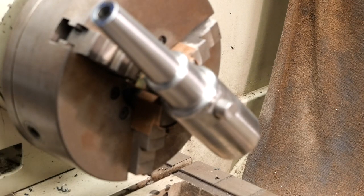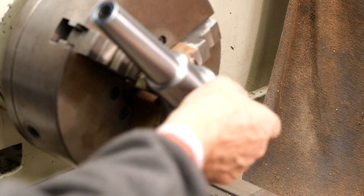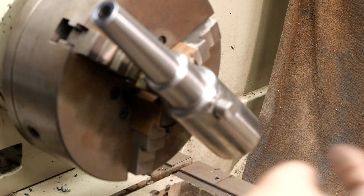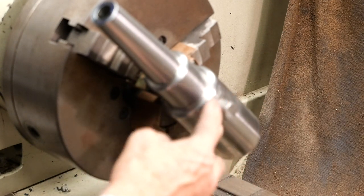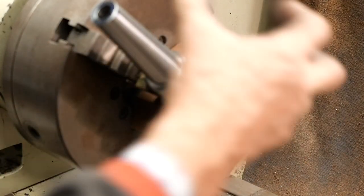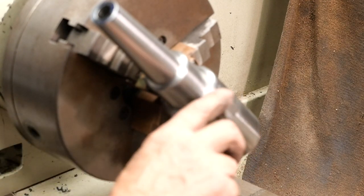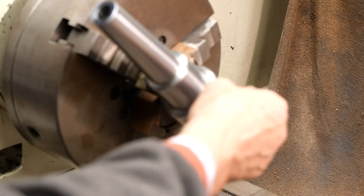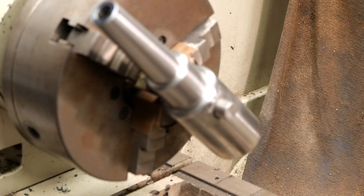John here again. I couldn't figure out a way to round over the ends of the trunnions. I suppose you'd say I should have rounded them over before I put them in, but the trouble is you never really know how deep they're going to go in when they're being secured. The length of the trunnions was determined after they were in, and I machined them to 15.5 millimetres — but now I need to round them over.